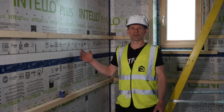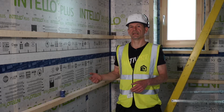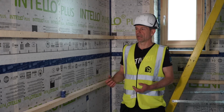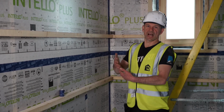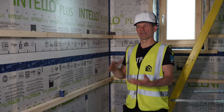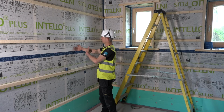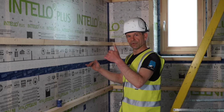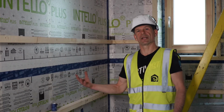It's pretty much all about the right density of installing it. And we express the density in kilograms per cubic meter. That's the term we are using. Different cellulose brands would give you different charts of what density you have to achieve in a build-up. So for example, the voids could be smaller or not as deep. You need a bit less density. Rule of thumb, the wider and the deeper and the steeper they are, the more density you need.